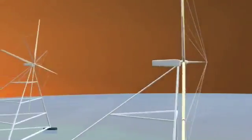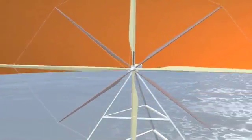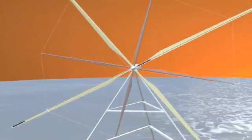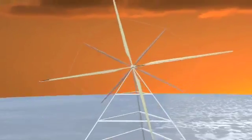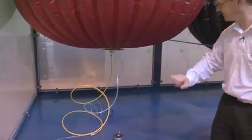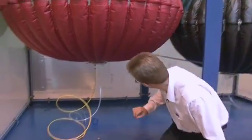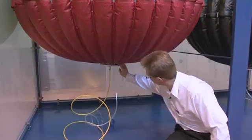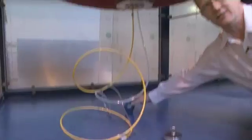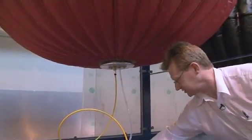We start with a primary energy harvester of some description. The best of those is a giant wind turbine, and this wind turbine compresses air by having parts moving internally inside the rotor. The compressed air comes from the rotating part into the tower, brought down through ducts to the seabed. You have to picture that this point is tied down to the seabed via an anchor — in this case, onto the bottom of a tank.